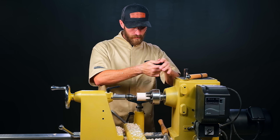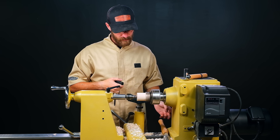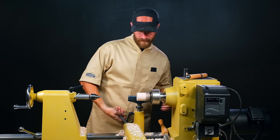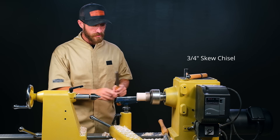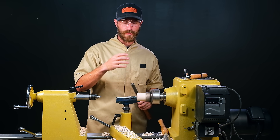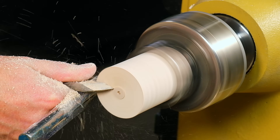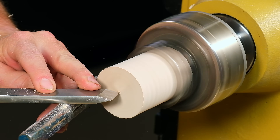Give that a quick spin — because we're not sitting flat on the bottom of the jaws it's not going to run perfectly true the first time. We can use our revolving center to get that right on center. Now we'll tighten this down and it should run true. Now we can take away the tailstock and we'll use a skew just to square the face of the blank — it's a little bit rough sawn right now and that Forstner bit will tend to wander on that face. Then we'll recreate that dimple to help that Forstner bit get on center.